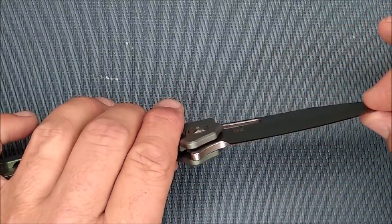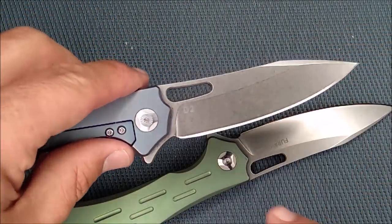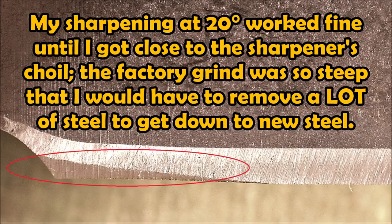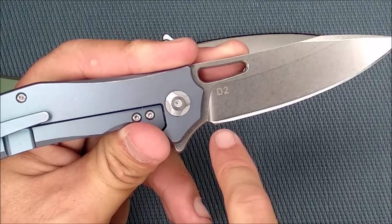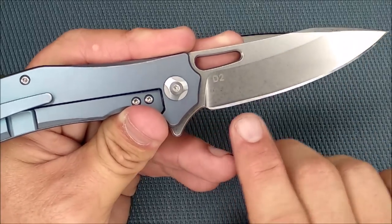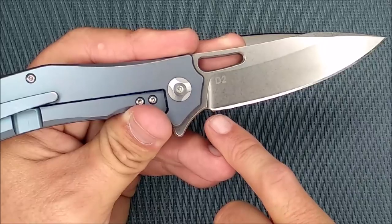So it takes a fair bit of work to get the grind angle down to 20 degrees per side, which I did on this one but didn't do it completely. I'll show you a closeup of the blue knife — there's a slightly different color right there because I just didn't want to keep removing more and more steel to get down to that spot, since it was ground so steeply the steel just goes away.